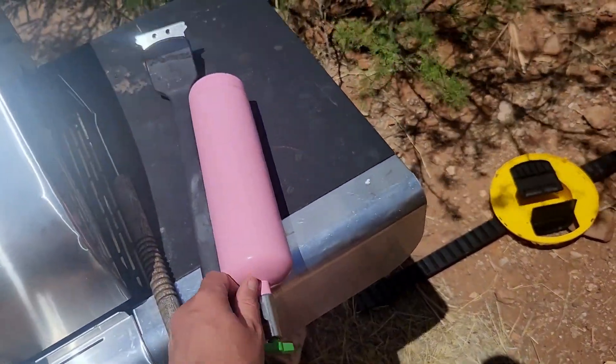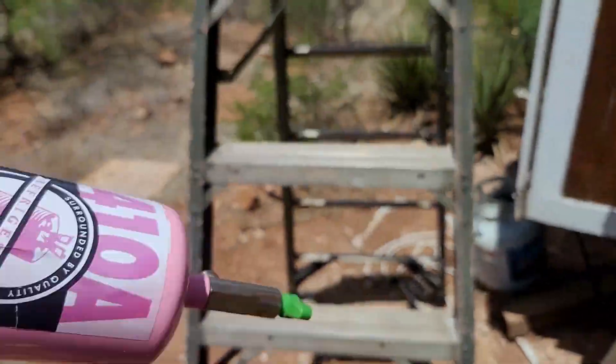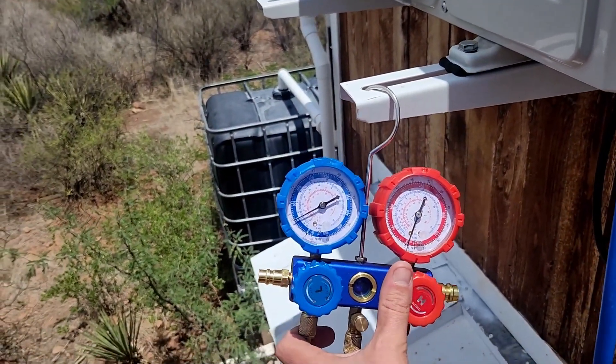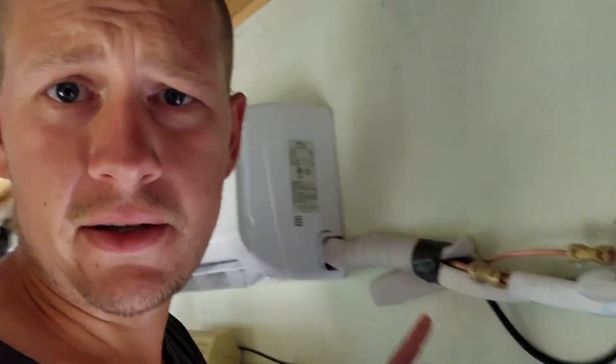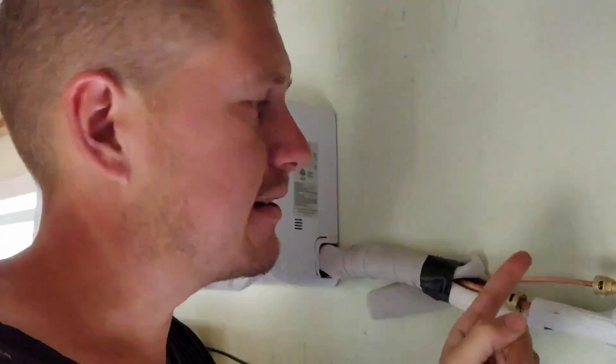The system has been vacuuming out for about half an hour, it's shut off now — we wait and hope the pressure holds so I can have air conditioning. We got up to 50 psi but we need to get to about 120, so I'm glad I ordered a second, larger bottle. I also took some high-grit sandpaper and cleaned off each end of the line because it was still leaking at one connection, and now we've got cool air coming out, so I'm going to let this run for another hour and see if that 50 psi stays.